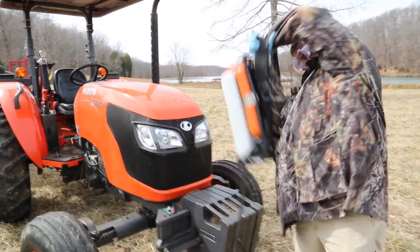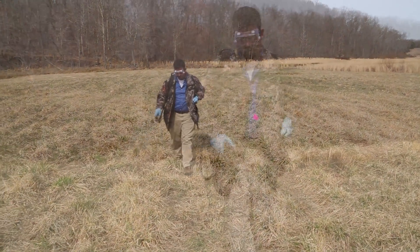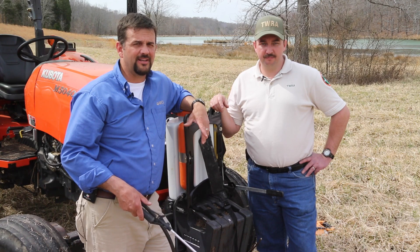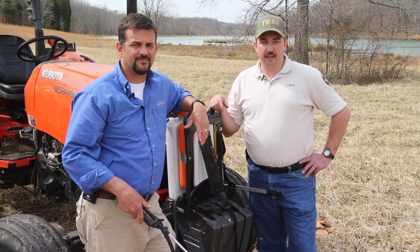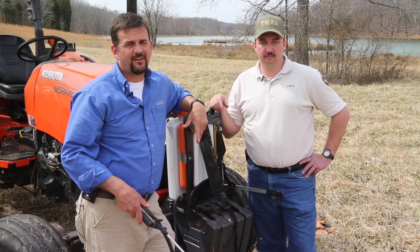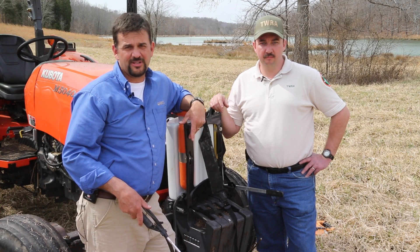Set up an 18.5 feet by 18.5 feet square, as this is approximately 1/128th of an acre. Fill your sprayer and begin spraying the square, timing at the same time. Make sure you use consistent speed and that your sprayer has consistent pressure. For this example, it took our sprayer 55 seconds to spray the 18.5-foot square. Now measure how much your sprayer collects in 55 seconds by spraying directly into a five gallon bucket, then transfer the water into a measuring cup. Our sprayer collected approximately 40 ounces, meaning the sprayer is calibrated at 40 gallons per acre. Using the 1/128th method, we convert directly from ounces to gallons per acre. With a four gallon backpack sprayer divided by 40 gallons per acre, each backpack treats a tenth of an acre.